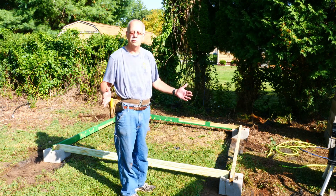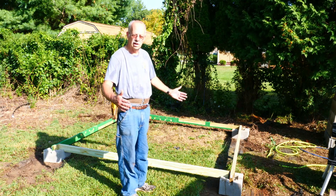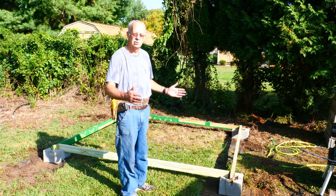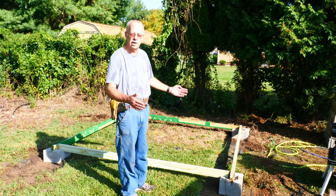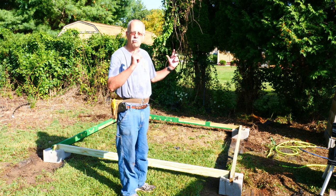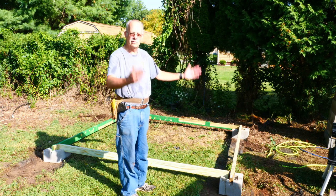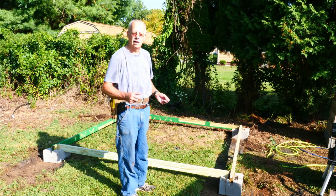The shed is going to be 8 feet wide, and the finished outside dimension on the length is also going to be 8 feet, but I need to make the deck 2.5 inches smaller to allow for the 1/2 inch of sheeting on both ends plus the 3/4 inch rake board on both ends. That way when I put the roof sheeting on, it comes out even at 8 feet and I don't have to try to add a little piece in or anything like that.